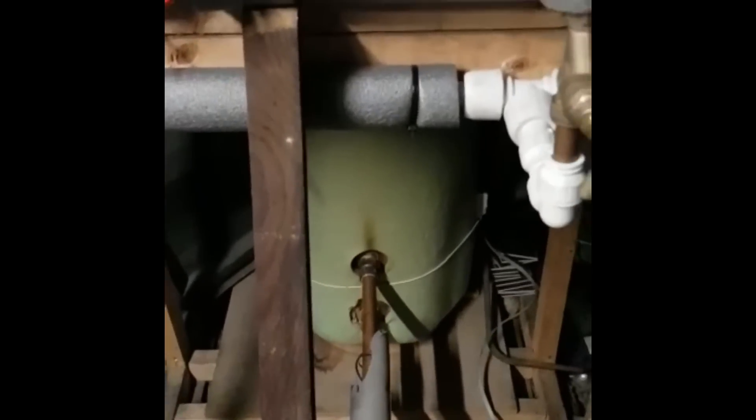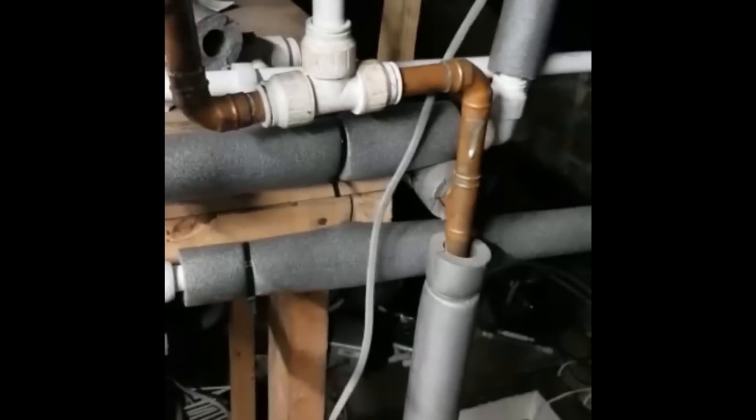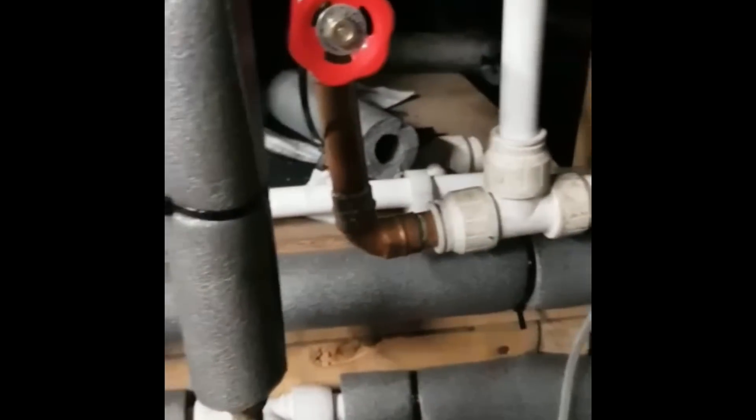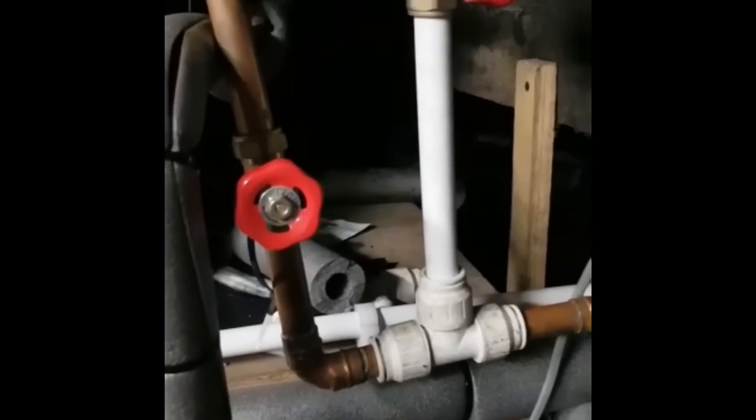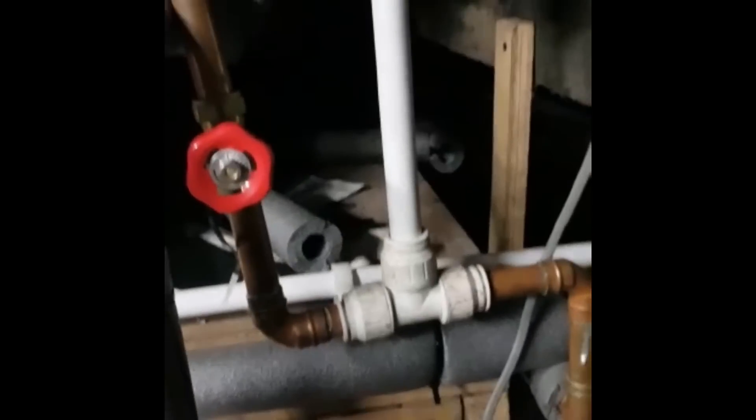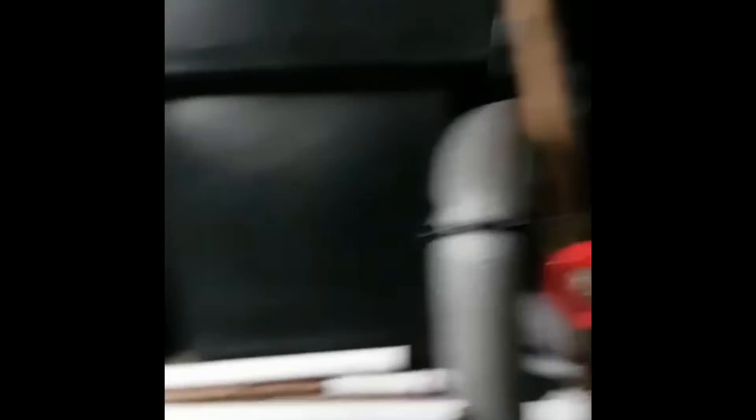Then it goes down to 15mm and out of the wall. The worst part: this cylinder is low pressure and the other is high pressure. To get it to work, you'd have to go into the loft and work out which gate valve to shut — open the feed for the hot but close the blow-off for the existing system. Once the boiler is back up, someone must access those taps, but the staff here can't physically get into the loft. If you leave that blow-off shut, that is a ticking time bomb. You need to know what you're doing when installing on unvented cylinders.